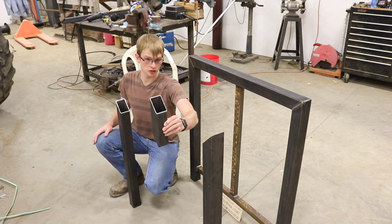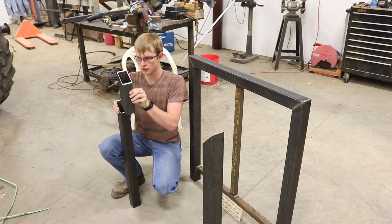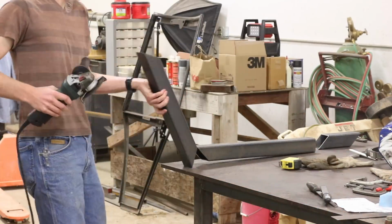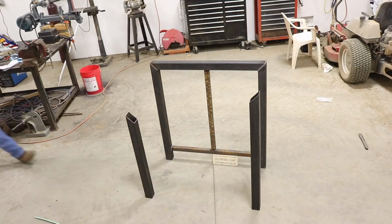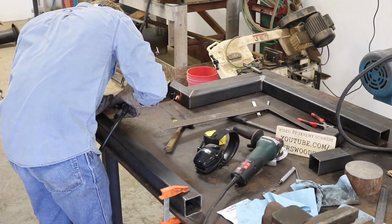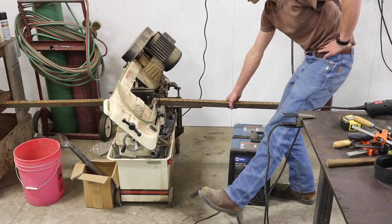This is that jog piece that goes in the middle to create the notch. If I put it on top of this one, it makes this leg the same height as all the others. So it's sort of like I've just cut this piece off and scooted it over to here. Now I just need to make the piece to fill this in and this. Need to put in the 1.5-inch tube across the bottom and up the middle.